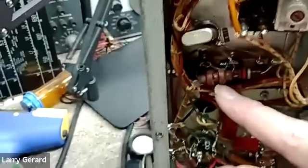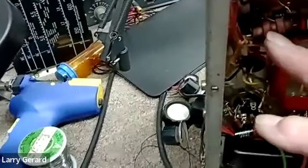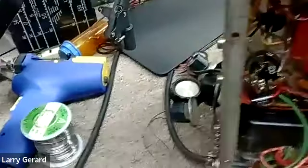And when I was working on this one here, I know this is supposed to be Tombstone radio night, but we can share whatever. This coil is bad in this one. I was messing around with it, I think, and the wire came loose in between the two coils. There's two coils, but the little fine wire that goes between one and the other came loose, and it's on the inside. So hopefully I can take it out of another radio and run it under the junk. But that's just the calibrator one for the needle. It doesn't affect how the radio works.